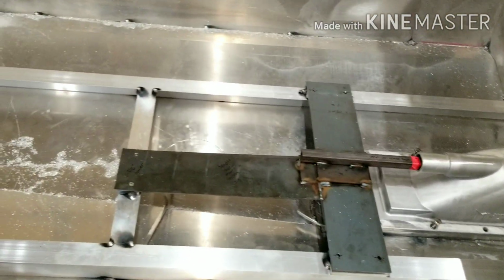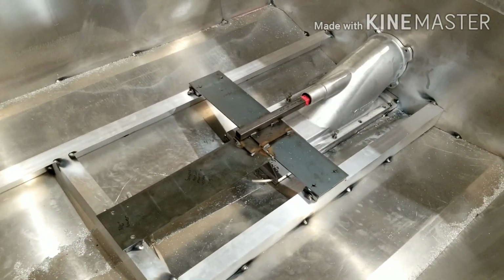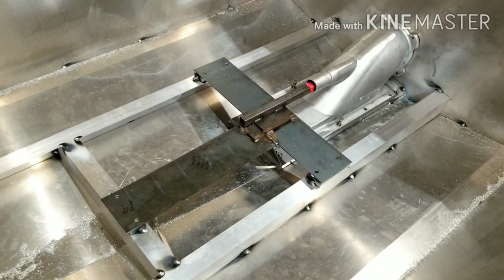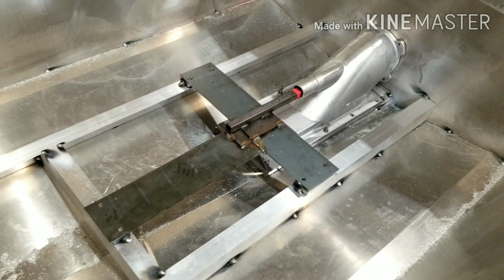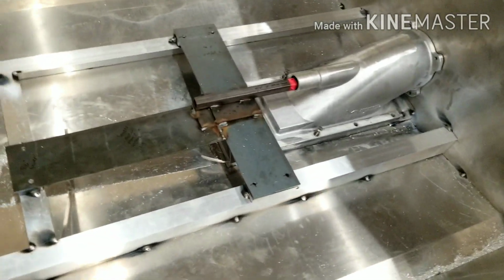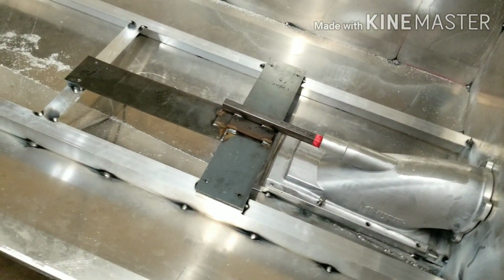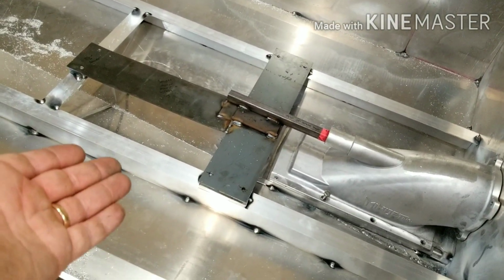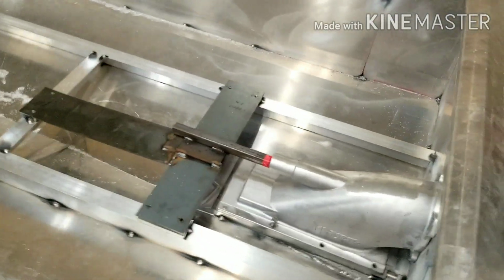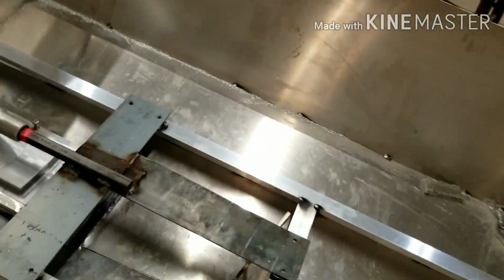Anyways, back to the motor mounts. So, I'm going to tell you right now, if you ever plan on building a jet boat, whether it be from complete scratch, a Jet John, Frankenjet, whatever you're going to do, and it involves you manufacturing your own motor mounts, highly, highly, highly recommend making a jig. This made my life super easy. It's all lined up, and I guess the tale will be told once we set the engine in, which we're about to do. So, I'm going to show you up close what we're working with here on the motor mount.